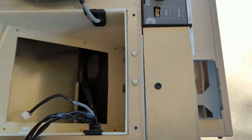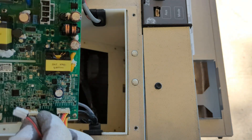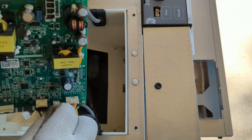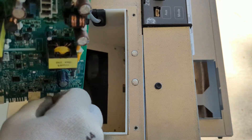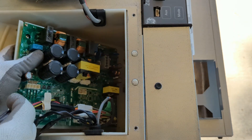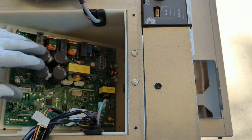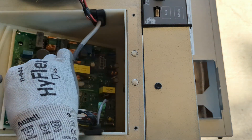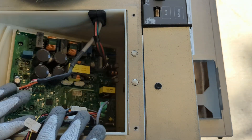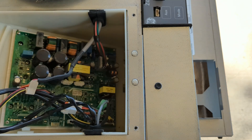This wiring harness here was for our make-up air fan and damper — they are completely separate since they were connected on both ends. We'll plug these connectors in, and we've got one more here to plug in. These wires are long enough to connect outside, but the others we're going to have to put the inverter board in place to get the others connected. We'll connect this one here and get our last connector connected. With everything in place, we can go ahead and put our screws back in to secure the inverter board.